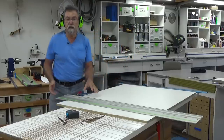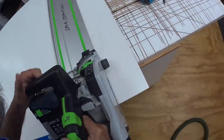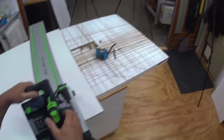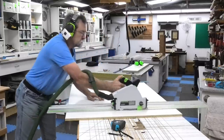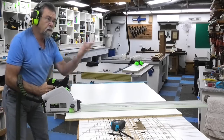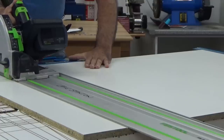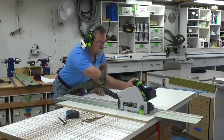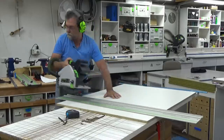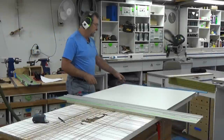Now that can't go anywhere. I can do the cut straight away. As always, I do a reverse cut with the track saw at two millimeters deep first — this can't move. Now I'm going to do a forwards cut. This is 16-millimeter board. I'll go slowly. Take that off — not a bad cut.